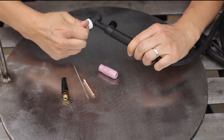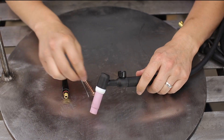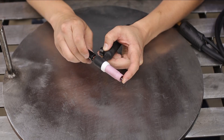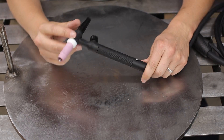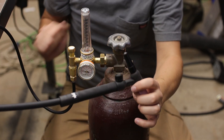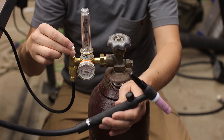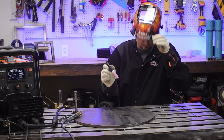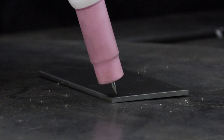TIG time. You can run the machine as a scratch start without the foot pedal, but I opted for it because it does give you amperage control. Once you add in the time for the torch setup, tungsten grinding, and gas hookup, it does take the longest — I was right at about eight minutes. Harbor Freight, if you're listening — one thing that would really take the Omni Pro up to the next level is adding high-frequency start. You do get lift-style TIG, so to start the arc you touch the tungsten to the workpiece, step on the foot pedal, and as soon as you lift up — thus the name — the arc is created and you can start welding, controlling amperage with the foot pedal.